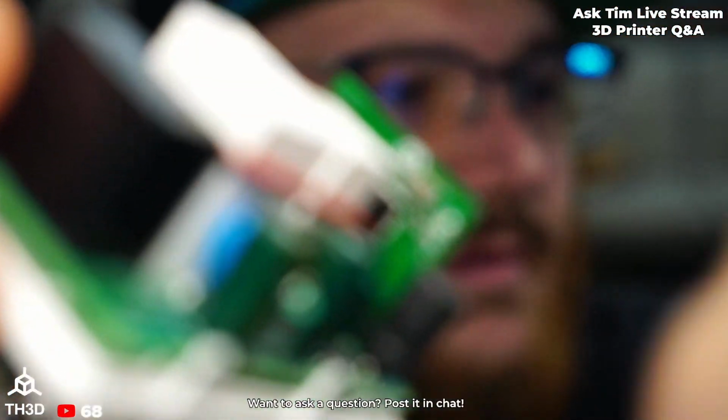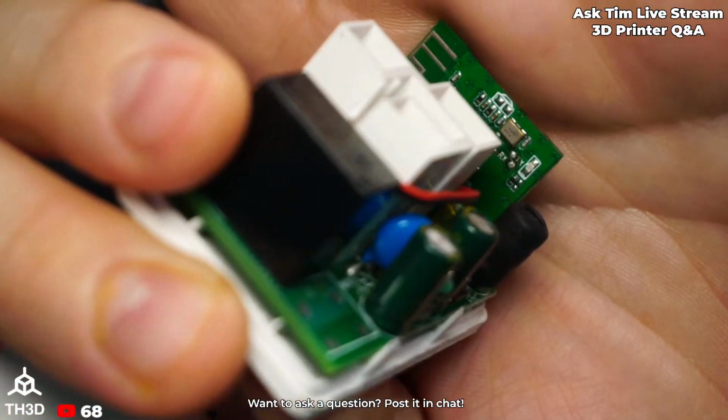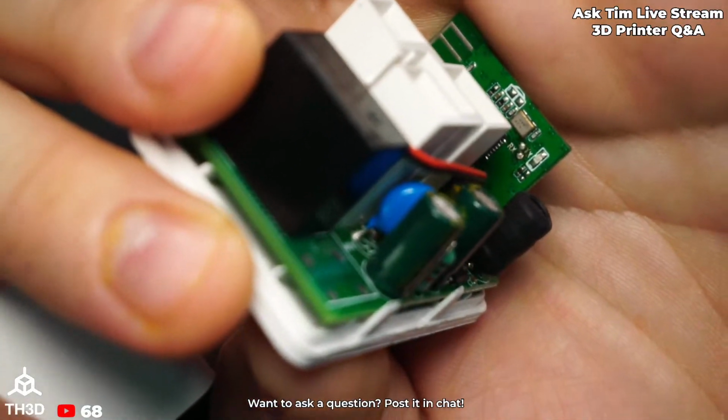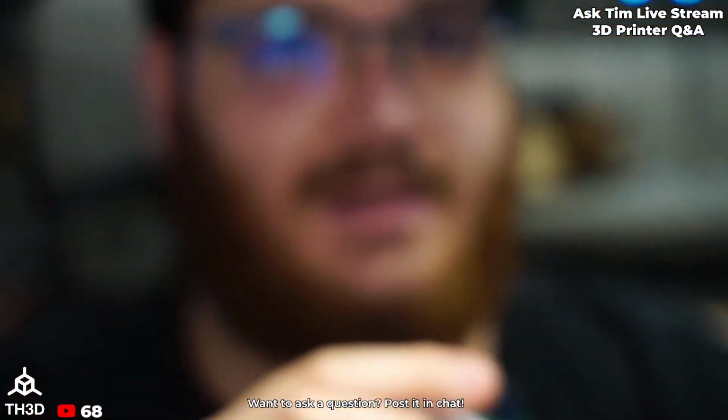Let me see. If you guys see here, do you see those? There's TX and RX pins. So if you bail out a bad flash, you would have to get inside and tack on some leads and program this with something like an FT232R programmer. But as long as you're close to your access point and you're not having power issues, you should be fine updating your stuff.